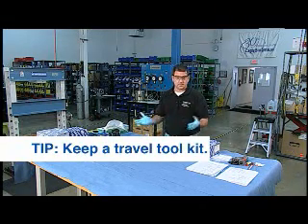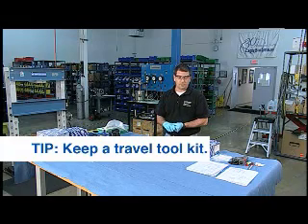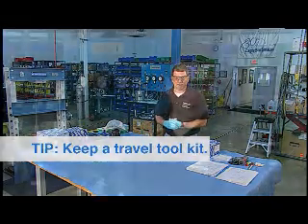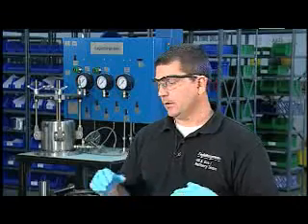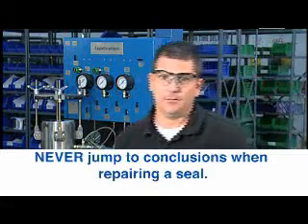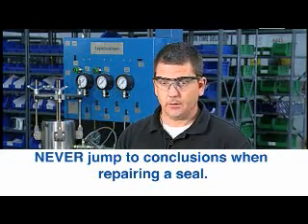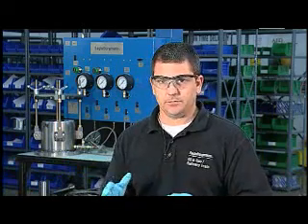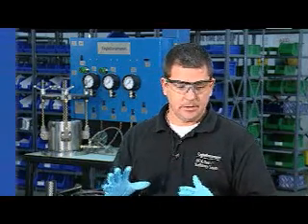Here are some tools and equipment that you are going to need — things you might want to keep in a kit and travel with you. I keep a lot of this stuff in a kit that I take with me just in case the customer doesn't have those on site. A mistake that a lot of people make when doing a seal tear down or seal failure analysis, particularly if you are on site with the customer, is that there tends to be a bit of panic. The wrong thing to do is grab the seal, take it apart, look at the faces, and jump to a conclusion. Not only is that not a very good way for establishing a cause, it can also be quite dangerous and sends a very poor message to the customer.